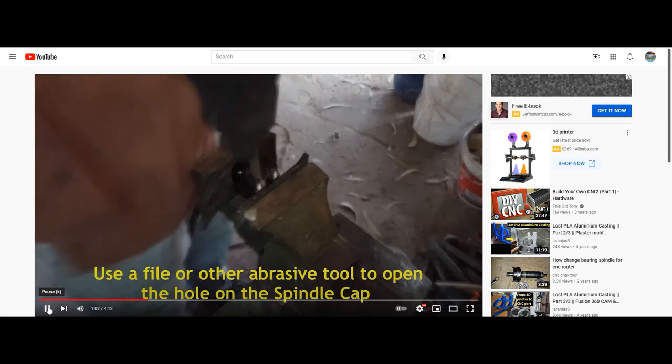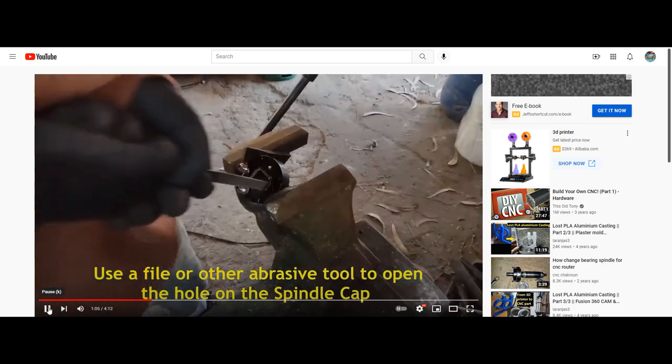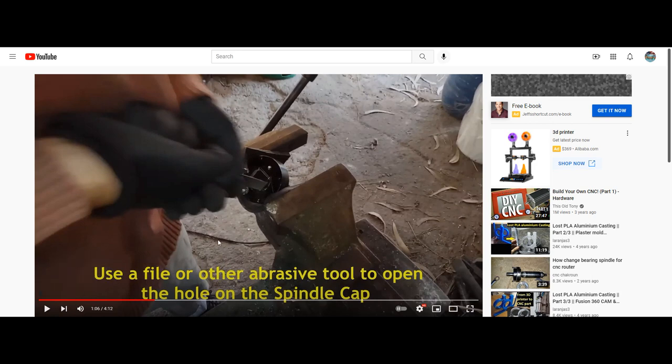And just before we even get there, he is going to replace the round panel mount connector, which is an auto-locking connector in that it actually has threads on it. Many of you guys know if you have your spindle, it has threads on it so that the collar from the female portion of the connector, once it's inserted, screw locks on. It's an aviation-type connector for safety. He is replacing this spindle connector with an IEC power plug, which is used on the rear of most every enclosure to power the actual spindle, which is absolutely terrifying.